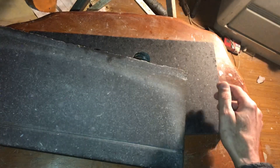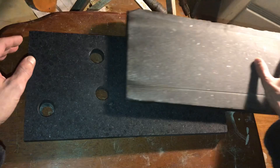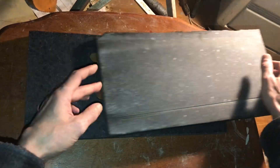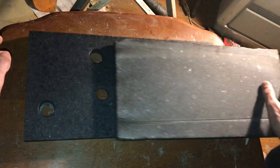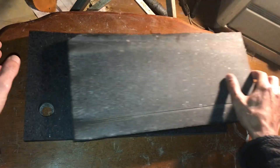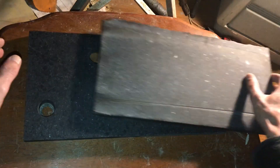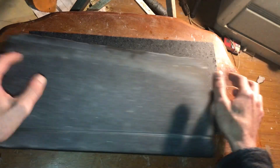No need for fancy machinery to test this — this is one of the ways you can do it. I'll also take it for proper optical testing of flatness on smaller areas. This is proving that across the whole surface it's actually precision-level flat. It's not the highest standard yet — I scratched it up a bit — but a few minutes of polishing, grinding, and lapping gets it back. Once you've started to get it right, it only takes a few minutes of polishing. It's still all done by hand.